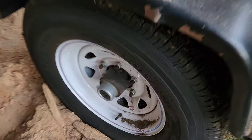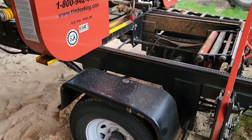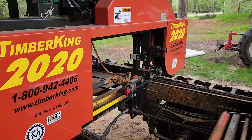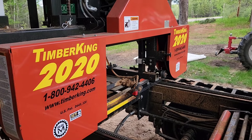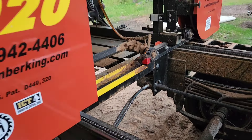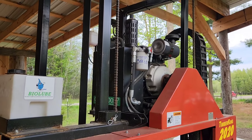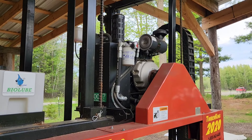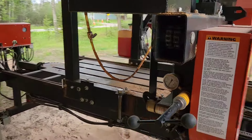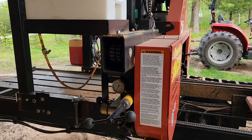We're going to check the hubs for grease. We're going to check the air pressure on the tires. We're going to make sure we're not bottomed out on the sawmill — you don't want it directly on the deck. It'll kind of mess up some alignment stuff; you want to have about an inch off. Over a long trip you may get some chain stretch, more so on the diesel engines than on the gas engines, just because you have that extra weight up there. Blade tension is going to be around 500 PSI. You want to keep a blade on there — it helps make sure everything rides a little bit smoother.